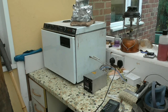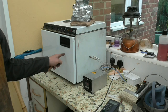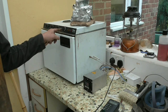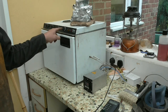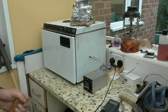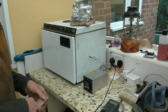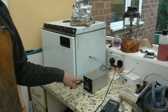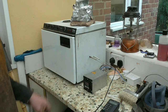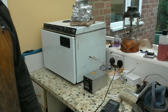A very useful piece of equipment in the knife maker's armoury is a good oven, but the oven needs to be as accurately controlled as possible. If you were to rely on the actual thermocouple which controls the oven here, it would not be quite suitable. So for my purposes I've got this Omron controller, which is a very good quality controller with a solid state relay. This basically turns the oven on and off and sets it up to become very accurate, allowing me to control my oven to very accurate tolerances.